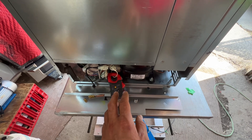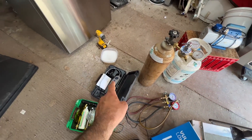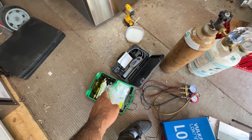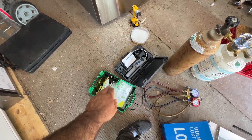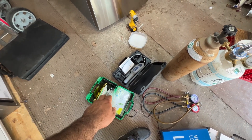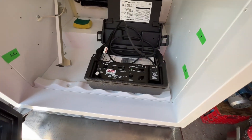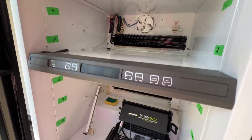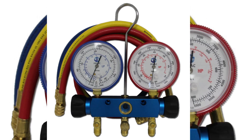If I'm really not sure about the unit — how bad the leak is or where it is — I can go with different detection plans. Dye is my last option because I use dye on units where I want to find the exact leak location so I can possibly repair it. At the moment, the main way I find leaks is using my clamp meter and checking my frost pattern. The H10 Pro is my favorite tool right now. If you have more experience with leakage in the system, you may not even need to use these tools — you can just look at the frost pattern and see how much frost buildup there is. Using gauges is also another good option.